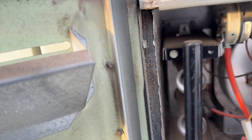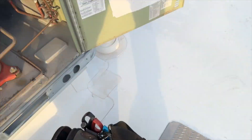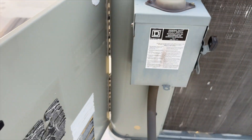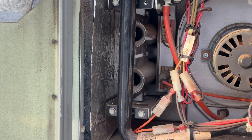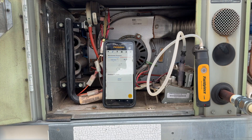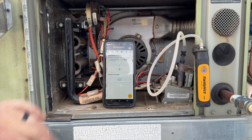We're going to pop it back in there and light this up to see if it actually rolls out. We got our rollout reset reinstalled — go ahead and turn this back on and call for heat. Recycling — inducer's on. We're going to check the gas pressure; it's super high, at 4.21, so that could be the issue. We're going to let her run for a little while to calm down because you can see it's already dropping.